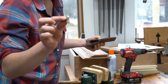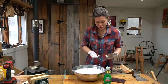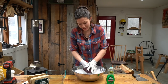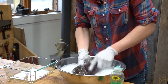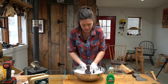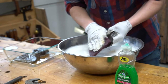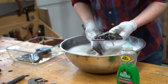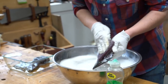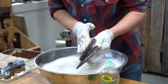Who would have thought? Such a tiny little piece of metal. After we've got all of the wood removed, we are going to use hot soapy water. Dish soap and an abrasive pad are a great way to do this, and we're going to try to get as much of the surface rust and dirt and grime off of these as possible. The more you can get down into some of this pitting with the washing, the better off you'll be when it comes to soaking it in citric acid, which is the next step.